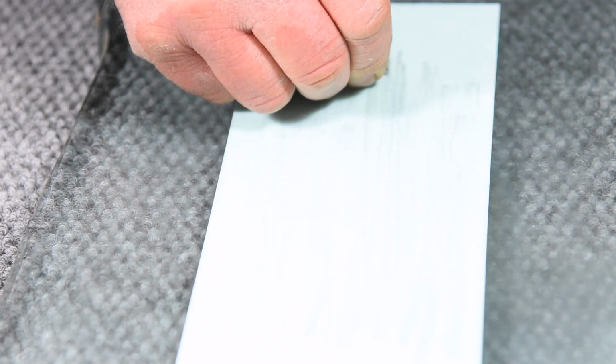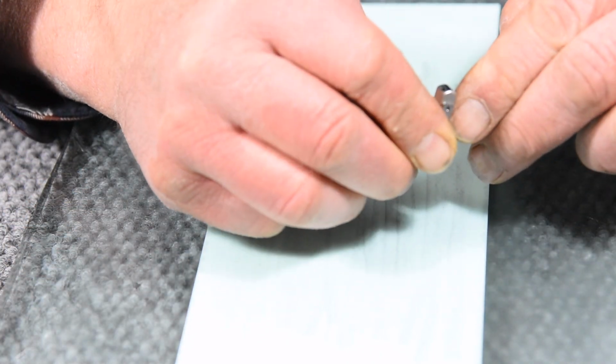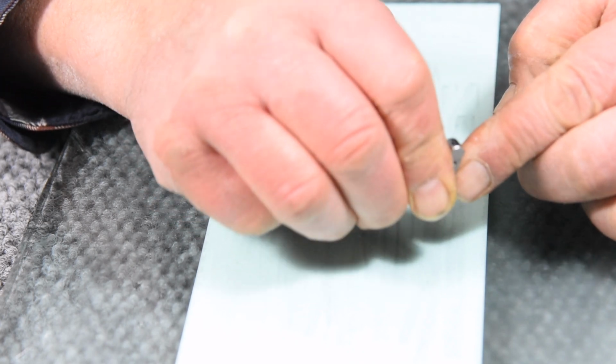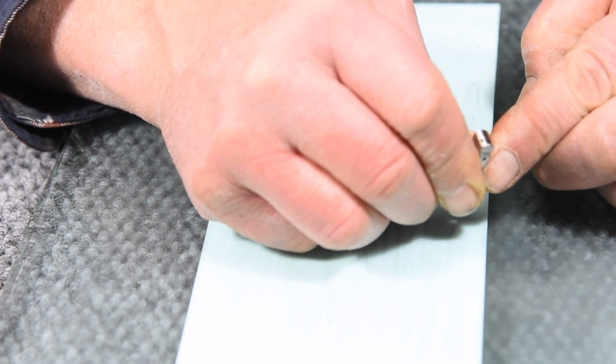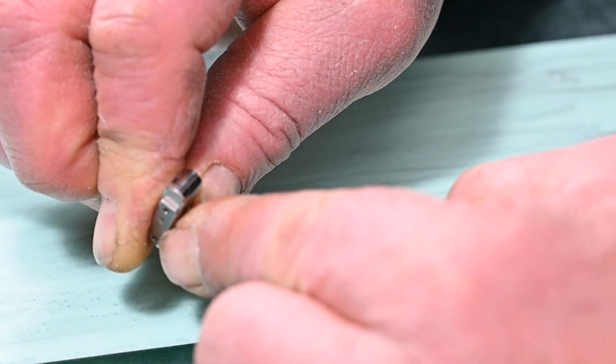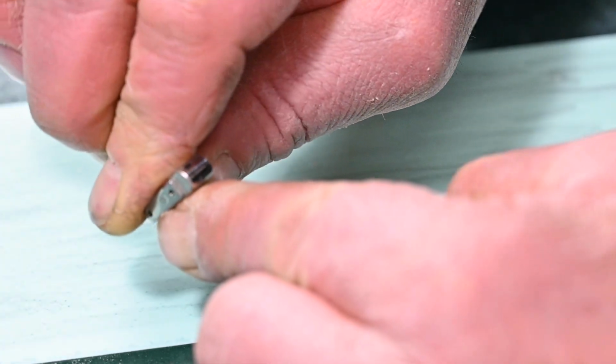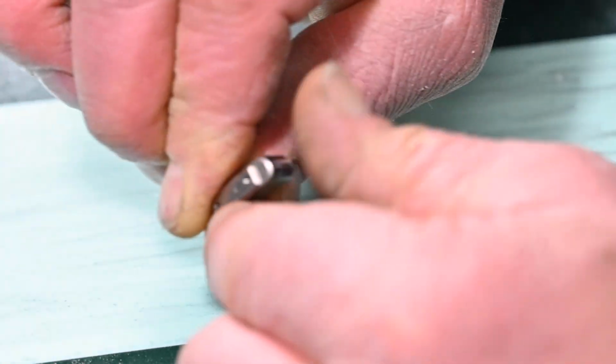So this is how I do it. Of course you can't see it, but I'm concentrating more force on the fore and aft than I am in the middle, because the middle has been flattened a little bit by the prior lapping, and so I want to build that radius back up. I want to repoint that so that I've got the correct tape wrap on the head.